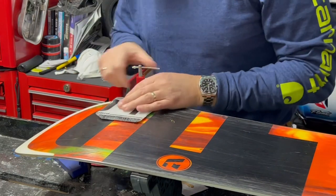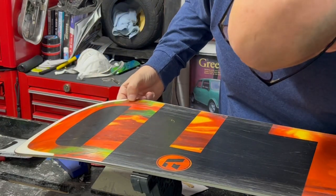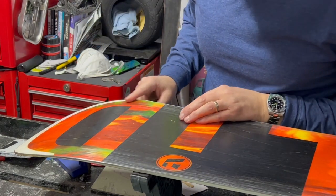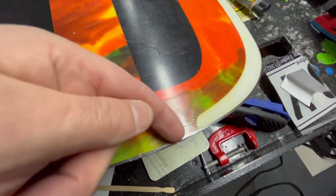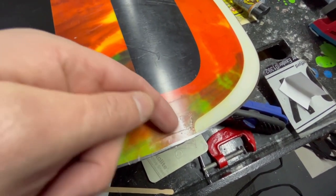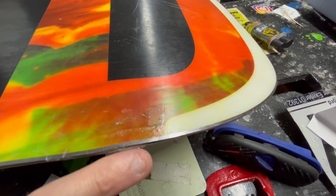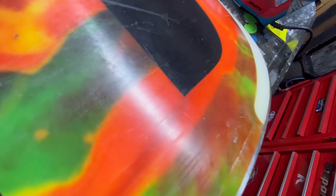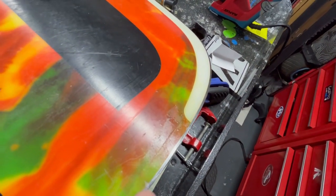Let's have a detailed look at this. That's really good — that's a lot flatter than what it was. You can actually see that line a little bit more prominently now, but it's just catching — where before it stopped, it's actually now flowing over quite nicely. What's really good is the epoxy is pushed out of the side of the rail, so what we've got has liquidized and gone in, obviously spread and squeezed out the residue, which is fantastic. That is a lot, lot flatter now — really pleased with that. And that rail is also a lot straighter.